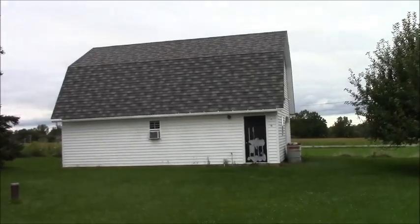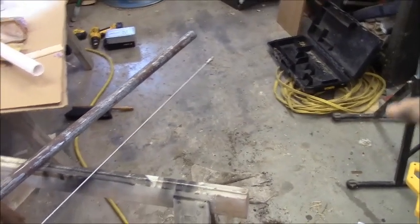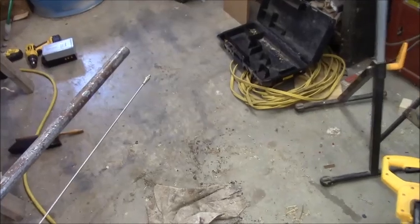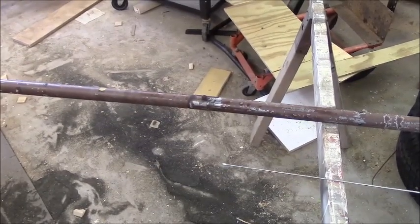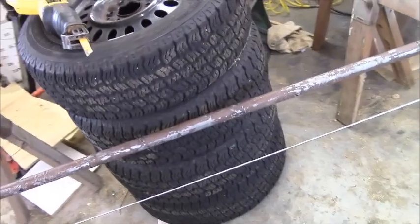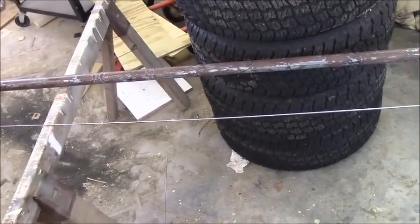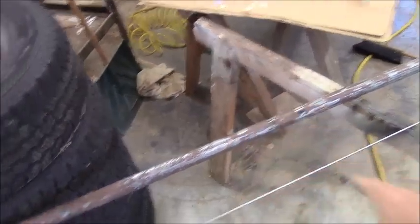Let's go to Bob's Barn Workshop. Before we start cutting and building anything, a little explanation of antenna theory. A lot of antennas, especially for CB, are what they call a quarter wave. This here is a stainless steel CB antenna whip that you usually see on trucks or cars — it's 102 inches long, which is a quarter wave of the average frequency for the CB channels. There are 40 channels and you're trying to tune this to be dead on at the mid channels like 19 and 20. Whatever slight variation in wavelength between channel 1 and channel 40 you just have to live with, because you can't tune on the fly. So what I'm going to do is cut the mast the same length as the whip.